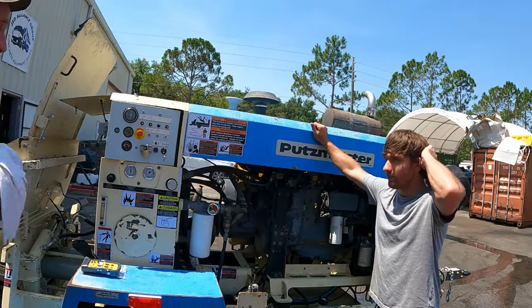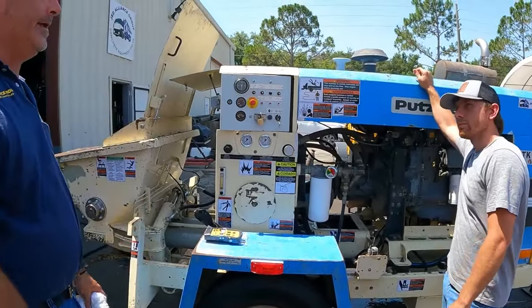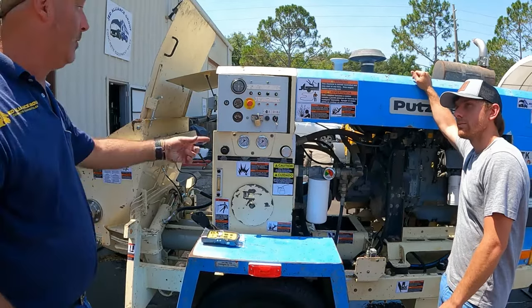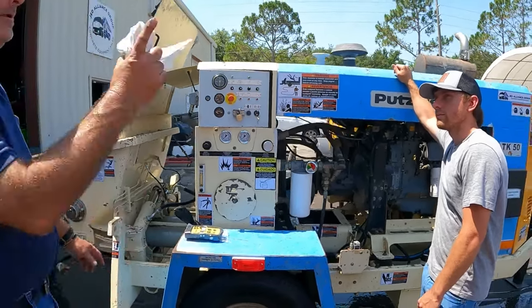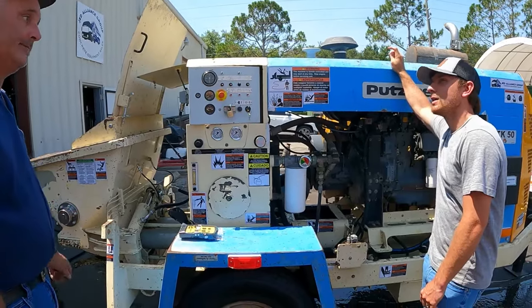Now you're going to call me and say, listen here, I turned the machine on, I got the flow all the way out and it ain't doing anything. Well, let's fire a switchover and hold it, and I want to see how much pressure you're building. Well, it builds 3,000. We know it's not hydraulic then, so we split the system. Now it's electronic. I got you.